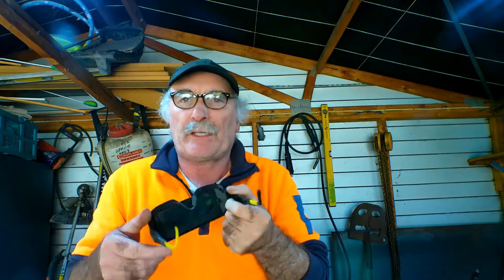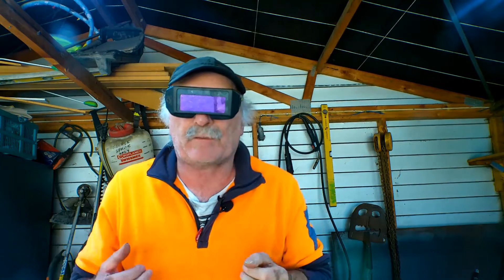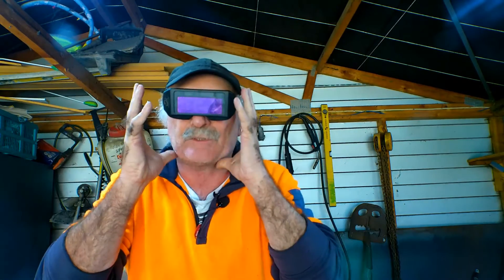They're really cool, they're easy to see through, and I thought yeah, this is it. Then I did like four or five hours of MIG welding and got a whole lot of skin burn around my face. My eyes were right, but the rest of my face, even with these big whiskers, started to burn like I'd been out in the sun all day. So don't arc weld or MIG weld or flux core weld with just glasses unless you've got a hood over the top. Otherwise it just sucks. That's a trick for young players — I learned that the hard way.